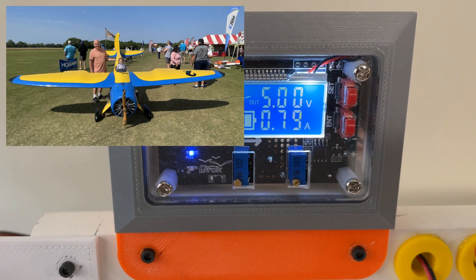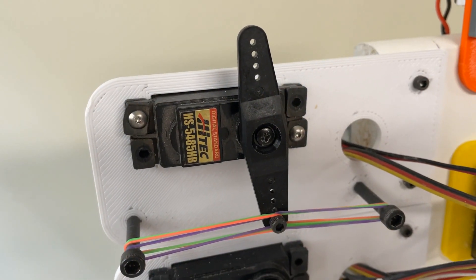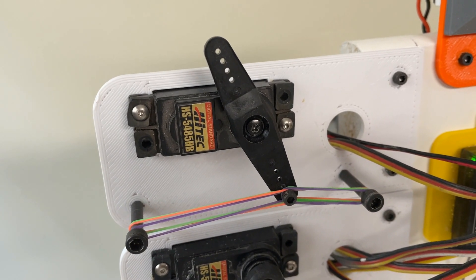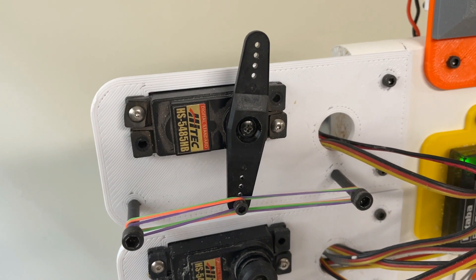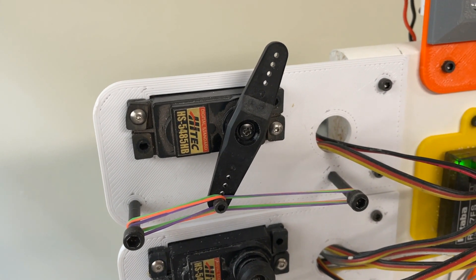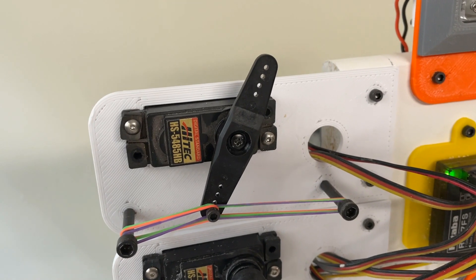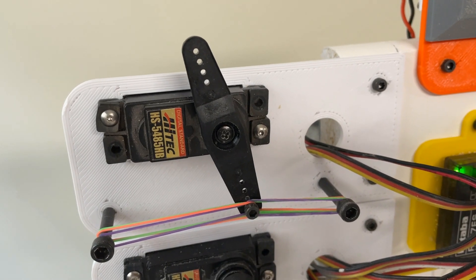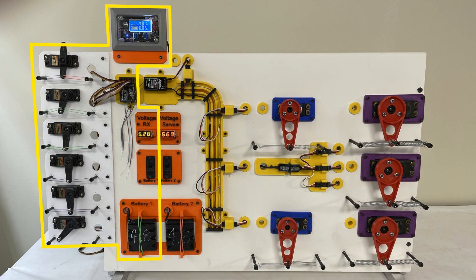Like on my 188-inch MSL2, that's the type of setup I have. I want to show how I can change the rubber bands to simulate different loads on these servos, to the point where I stall the servo and measure how much the voltage is dropping during a full stalled condition. This is just a demonstrator — all I'm trying to do is make people realize your voltage can be affected by the torque of your servos.